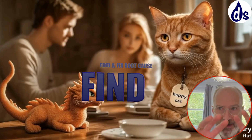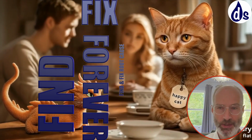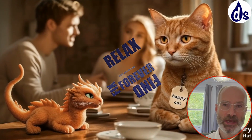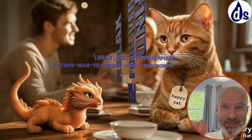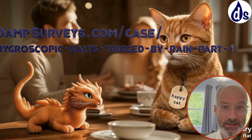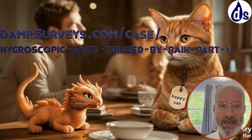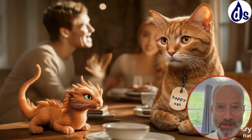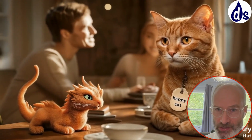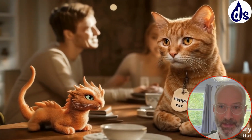If you continue to have those damp patches, it's because they're hygroscopic salts, and the simple solution is to paint a coat of oil-based primer such as Zinsser Cover Stain, and then you can paint whatever you want on top of that. So very simple, and think about insulation downstairs. Okay, thank you.